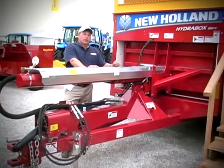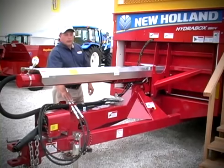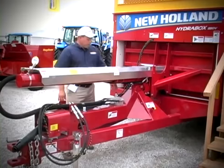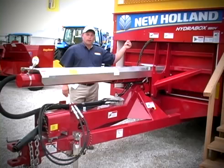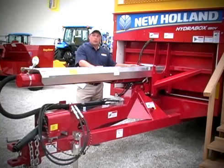Let's take a closer look at the details of the all new HydroBox from New Holland. These innovative new spreaders feature a system that only requires one set of hydraulic remotes. Through this hydraulic synchronizing valve, the end gate lifts fully to the raised position and then the hydraulic pusher begins to move the load towards the expeller.